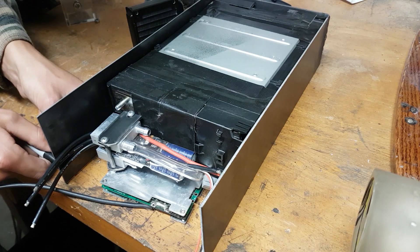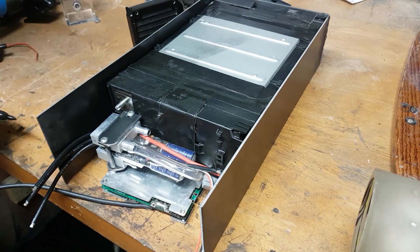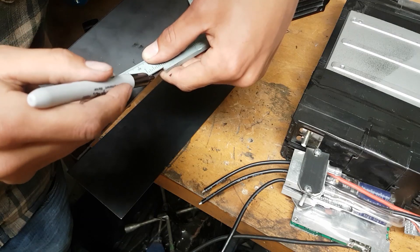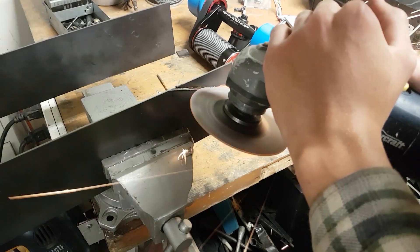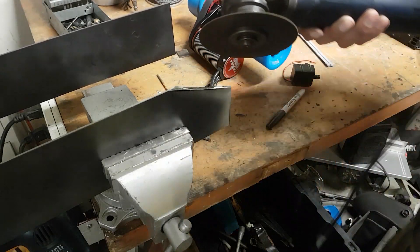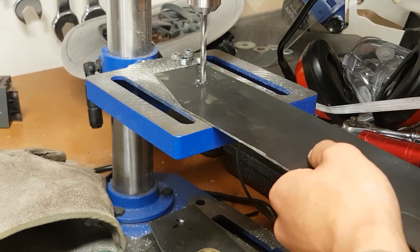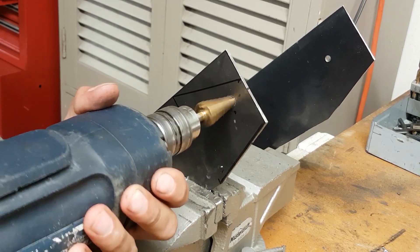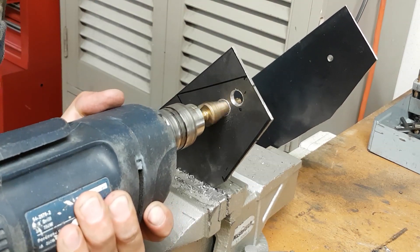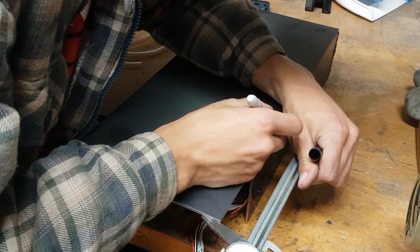I began with a portion of steel box and placed the VESC, the BMS, and the battery within the limits of the steel box so that I could mark how much steel I would need to cut off to properly fit the electronics. I then cut the angles with an angle grinder. The next step was to mark the holes required for the motor wires and the coolant lines on the steel casing, which I then drilled out with a drill press. I didn't have drill bits large enough, so I used a step drill to enlarge the holes for both the motor wires and the coolant lines.